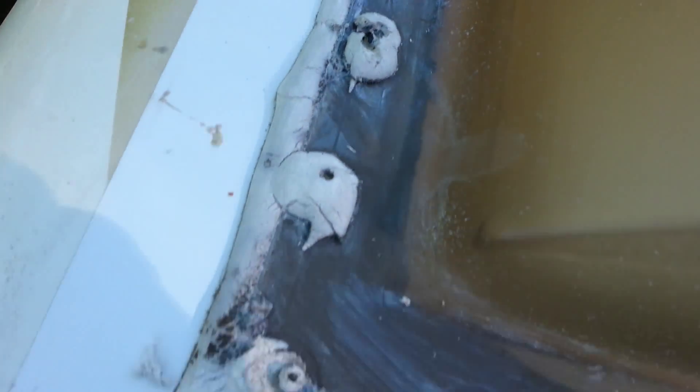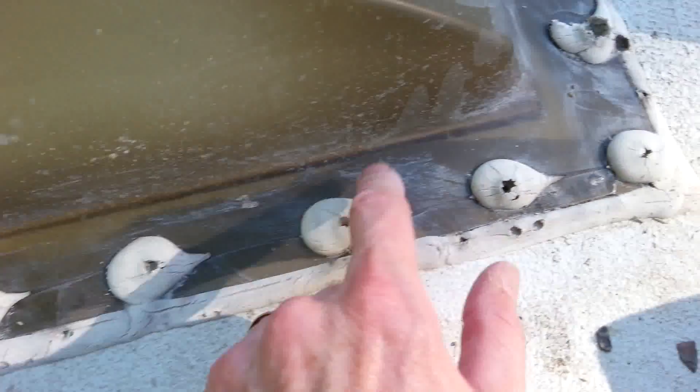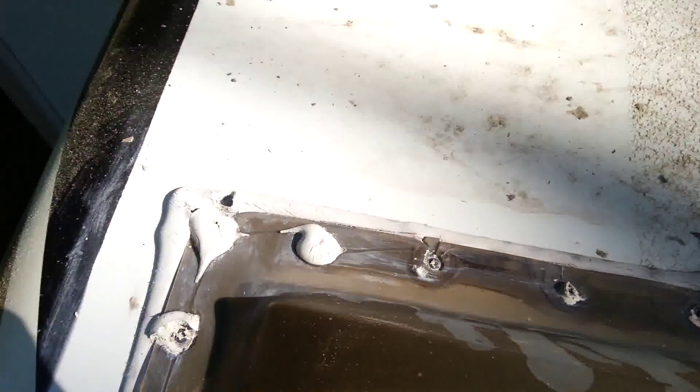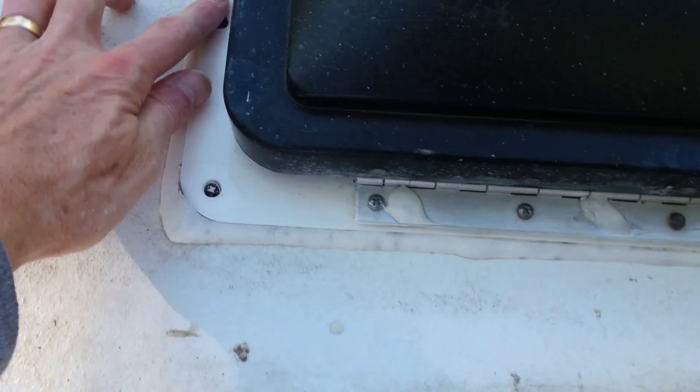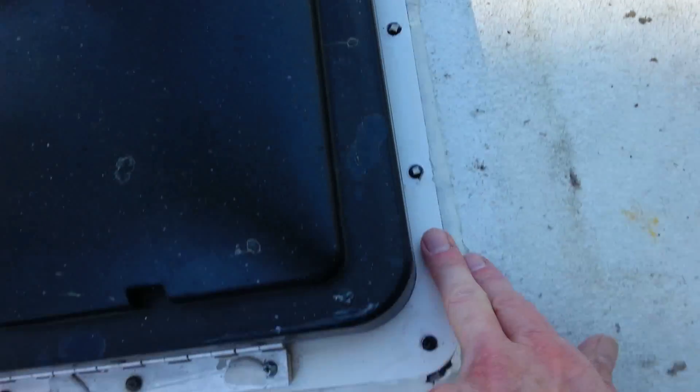I took some alcohol on the brush and brushed it off some. Expose the screw head, get it good and clean and put a reseal on it, keep her from leaking. Here we are at the skylight and as we was cleaning and scrubbing, most every one of these just peeled right off, exposed all the screw heads. So we'll get that sealed up.